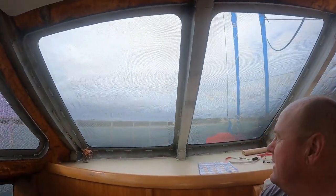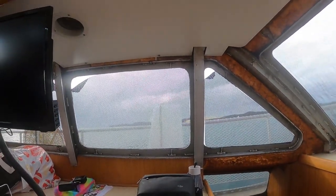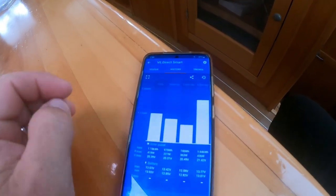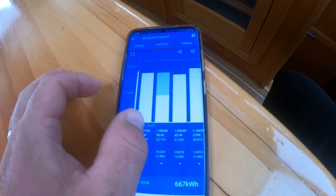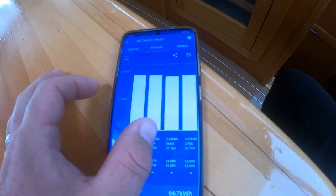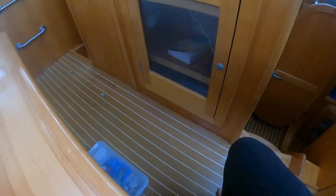Today it's pretty ordinary outside — it's blowing with a fair bit of rain, so it's the perfect day for boat jobs. One of the first jobs is dealing with our power shortage. Looking at our Victron controller, it hasn't gone to float — it's been bulk, bulk, bulk — and we're slowly getting behind on power. We want to go around and refine the boat as much as possible to see what is using power.